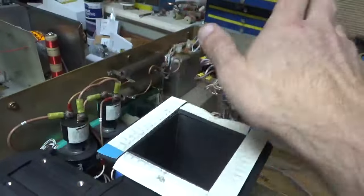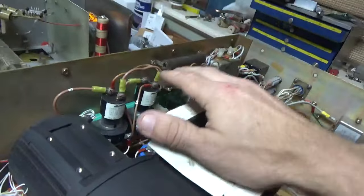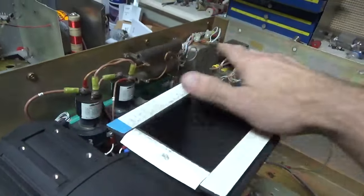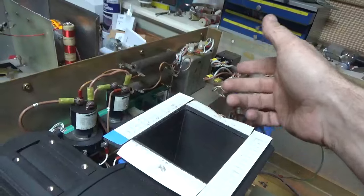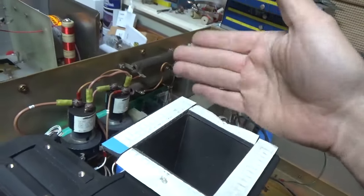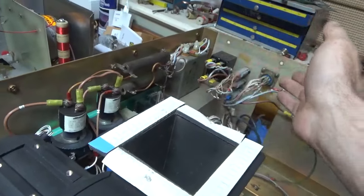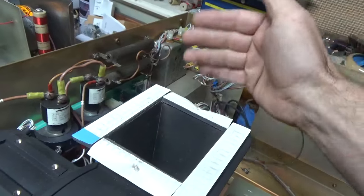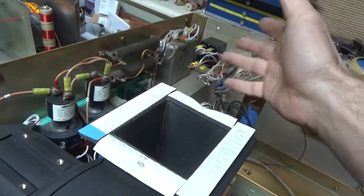I'll obviously watch the wire gauges and these contactors. I love mercury contactors. I've been using these since I was like 18, I think. They're awesome. Just have to be careful when you move something around that has mercury contactors. They can actually engage, the mercury will slosh around. And so you just want to make sure you have the covers on the item, so you don't get electrocuted by accident.